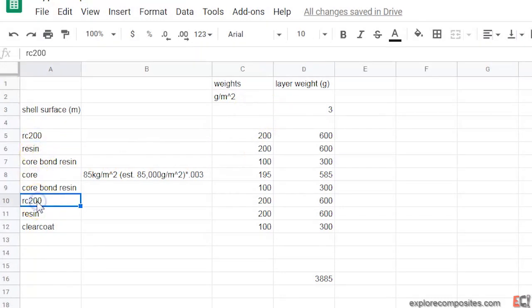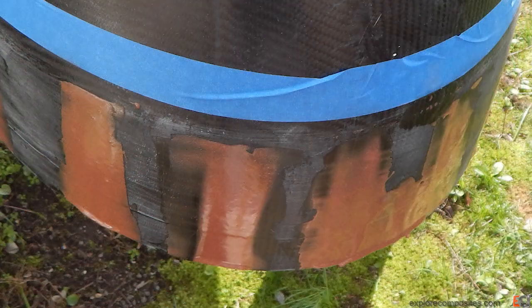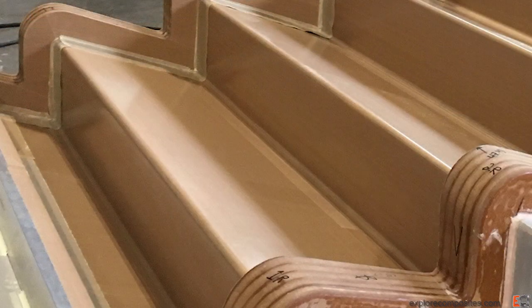The layup was originally intended to be done in multiple steps — with the first skin — and because of time I ended up doing it all at once. I think certainly using a better release system would have helped. The Teflon would have been great over the whole part. It would have saved a lot of time in finishing and minimized the amount of damage that I did while releasing the part. That was definitely a day's worth of setback, filling all that, before I could do the closeout taping around the perimeter of the part.